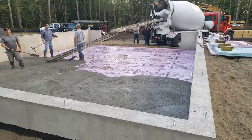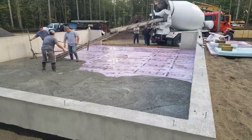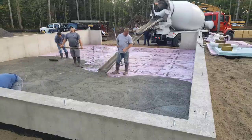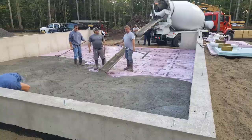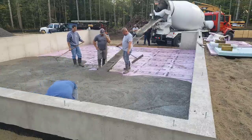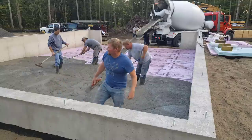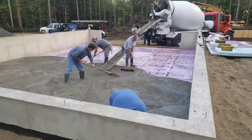We're using what we call come-alongs to pull that concrete around with. I got links for all these tools down in the description. We have a 16 foot chute, a 12 foot chute, a 10, and an 8 — we use all different sizes depending on what we need. You can see those are my two trucks in the background. We have all different sized straight edges too — we go from 4 feet to 14 feet in about 2 foot increments.